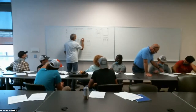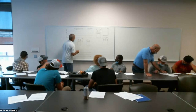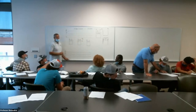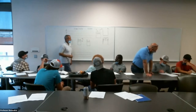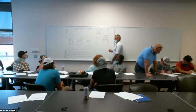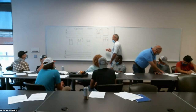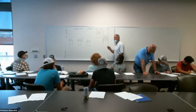Think of this as the primary side. Think of this as the secondary side. Everything lid, up. Everything secondary, down. So that would be how it is. Correct. Right. That's why I did this throughout the background and this one here also. If you took H down to here, well, you have 7,200 volts on the secondary side, and that's why we use transformers. Remember, they make no physical contact.